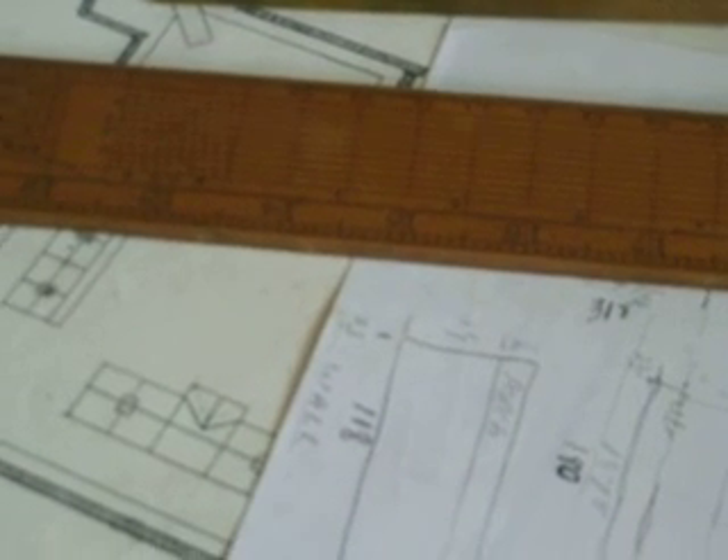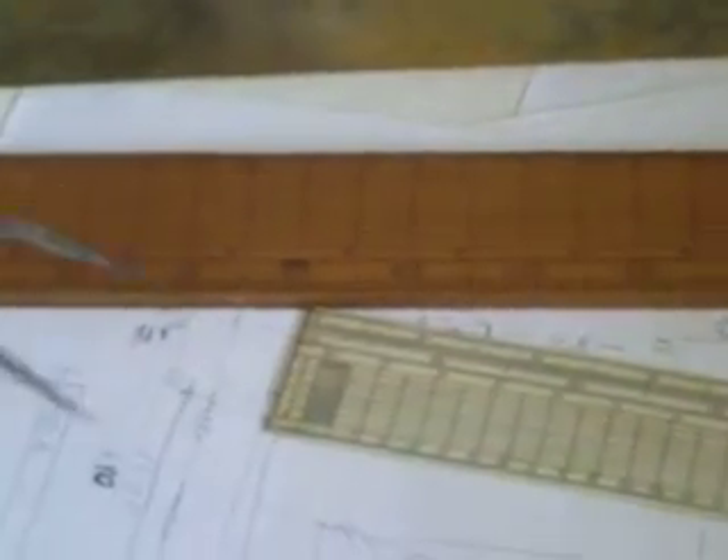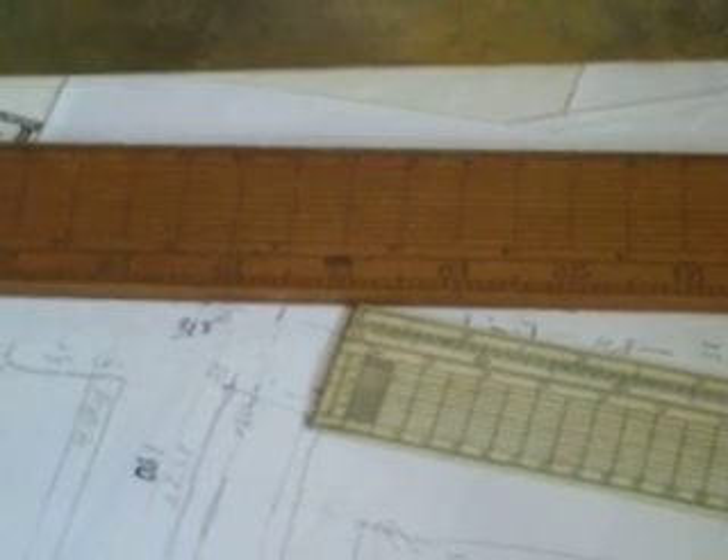So, when I was working on trying to get ready to draw what we surveyed yesterday — what we did was roughly 60 chains long — so I thought, well, maybe I'll do 10 chains to the inch, just to make a small little thing. So, if I was doing a 10-chain-to-the-inch scale drawing, how would I show one chain 68 links? Well, you can do four chains by using the quarter, you know? Going smaller than that, you've got to get down to some measurements which you're going to be off on. You just have to guess. Four chains to the inch — four and a quarter. Well, it's one chain to a quarter inch, or four chains to an inch, whichever way you want to put it. I have a half-inch scale on that one, but I don't have a quarter on that particular — but I have it on my one in my pocket case.